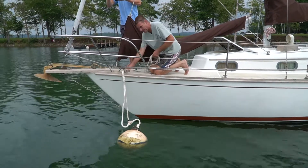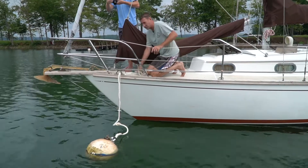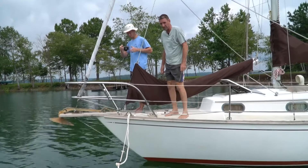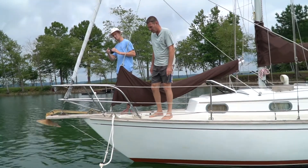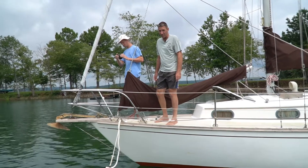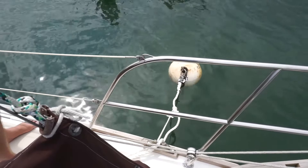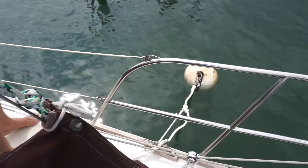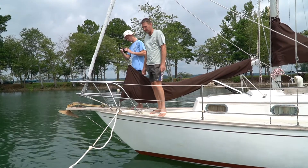There's no reason to change your pennant setup. And I can't stress enough — make sure the chain is tied off securely to your boat before you take off that top shackle. To lengthen your chain as the water rises back up, you'll do the reverse process: pulling up the chain, taking the shackle off and moving it to the end link or the appropriate length. That's how you adjust chain for change of scope.